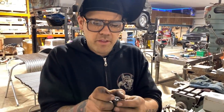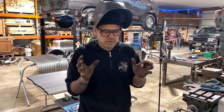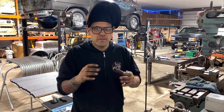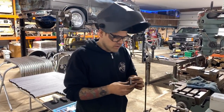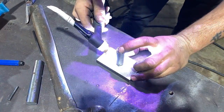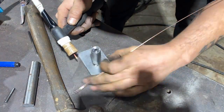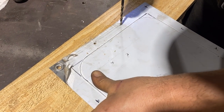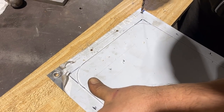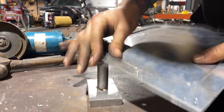Okay, so all I did was just make the outside diameter of our bubble a little bit bigger, just so that it allows a little bit more material into the bubble so that it doesn't stretch a whole ton in a small area, creating that crack. So let's try it again. Okay, let's give this another shot. See how we did.